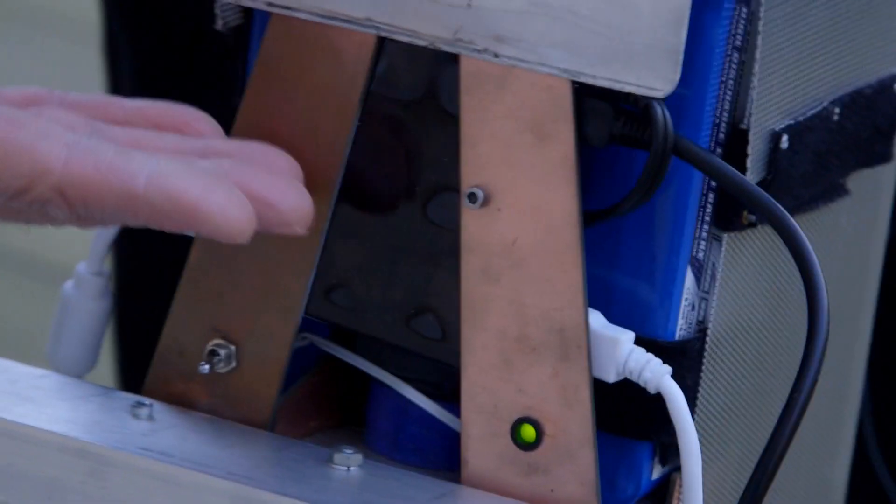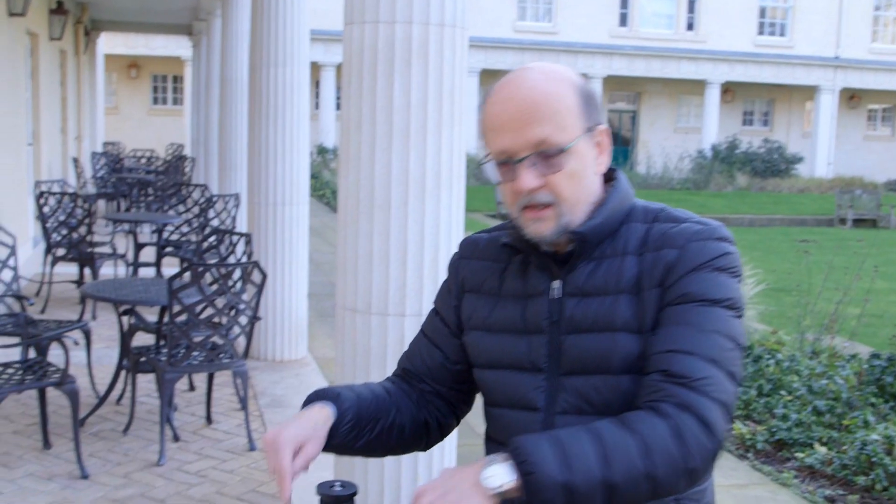There is custom electronics here, including a Raspberry Pi. On the Pi it runs Linux and it controls the cameras. It then fetches the JPEGs and via wireless transfer sends them to a tablet PC, which is normally taken by the archaeologist lying on the rock beside the scanner. On this tablet PC we get a rough 3D reconstruction online from JPEGs. At the same time we store the raw images in the cameras on the storage cards, and going home we take the raw images for doing the fine radiometric evaluation. Using structure from motion plus stereo, we get correctly scaled point clouds where distances between different points can be measured.